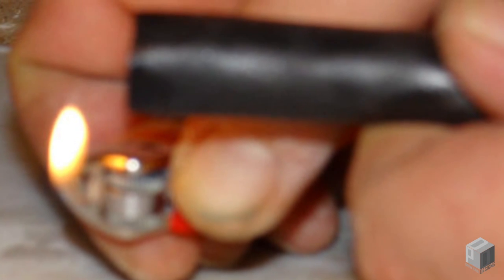Once the correct length is reached, begin heating the end that you are starting with. Make sure to make a tight seal. Next, heat the sides of your battery until the heat shrink tube tightly contours to the ripples of the washers. Then, trim the excess, leaving only a 1/4 inch, and heat until a tight seal is formed on the other end as well. Now we'll add our terminals.